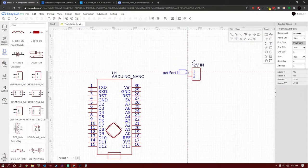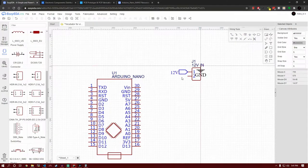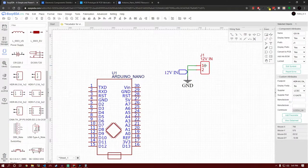The way net labels work is: if you have net labels connected to five different terminals, they are all going to be connected together in the PCB view, provided they all have the same name. I'm going to choose a net port, name it '12 volts,' and connect it to the terminals of the connector — this is where we plug in our 12-volt power supply. I'm going to connect the other terminal of the connector to ground. This ground will be common with the 5-volt power supply but completely separate from AC.